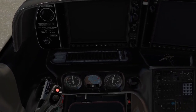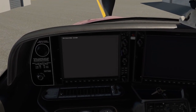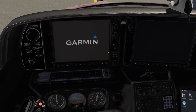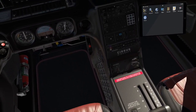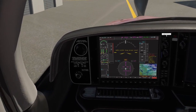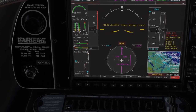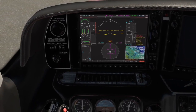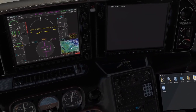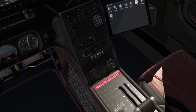Let's start with the startup routine. We start by turning on battery two, the emergency battery — a 30-amp battery providing power only to the essential bus via a one-way diode. It's only going to power the left MFD; verify the one-way diode is working by confirming the flap light does not come on. Once the left MFD is powered up, verify battery one is not discharging and the essential bus is getting 25 volts. Then turn on battery one to power the main bus — the second MFD powers up and the flap light turns on.